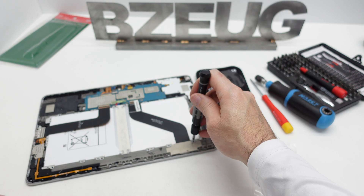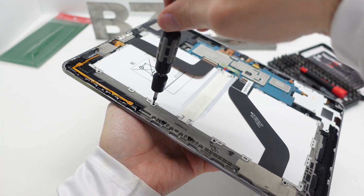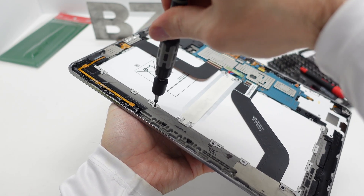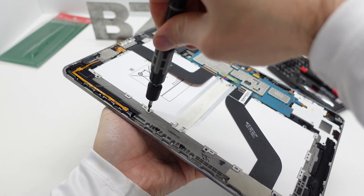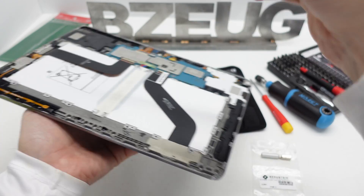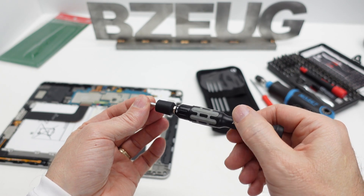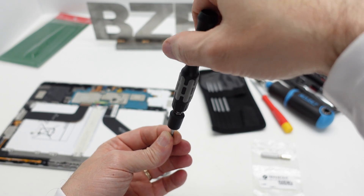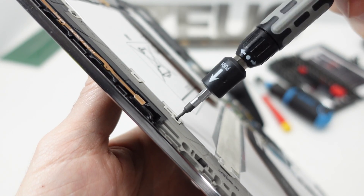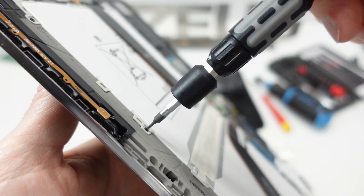What I found is that because the ratchet requires so much friction to actuate — see how it loosens the screw and instead of ratcheting it just tightens the screw back in, and it should be spinning. I have the ratchet set to loosen the screw, so I'm not making a mistake. See, it doesn't ratchet.